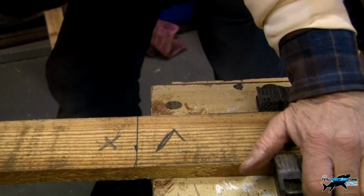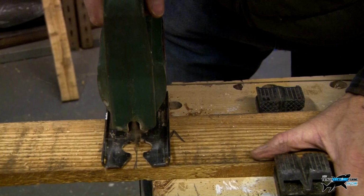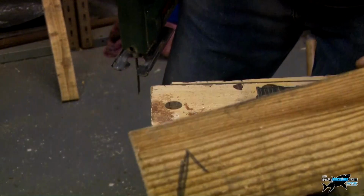Now here's another totally awesome tip. When you're cutting up lengths of wood that are very similar in size, it's pretty easy to get them mixed up. So when you place it down to mark it, you get your set square, you mark your line across, and then you put a cross or a tick, depending which piece you want. If you've got 30 inches, and the left-hand side is the good bit you want, put a tick on that side of the mark, and if the other side is what we call the waste or the scrap side, put an X. Then if you do drop them and you're cutting several different types, you're not going to get mixed up. You go, oh, the one with the X on, that goes over on the rubbish heap.